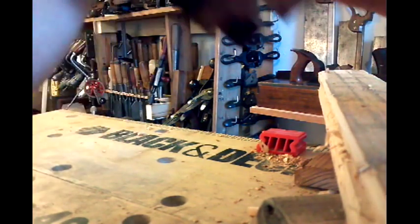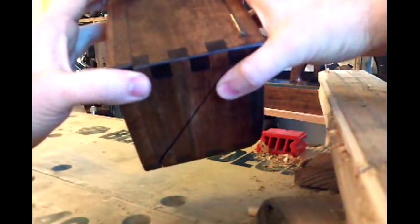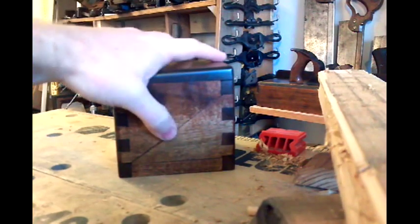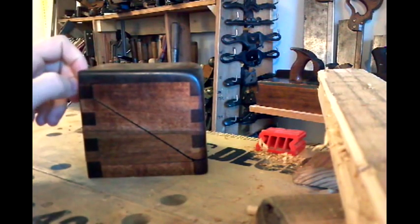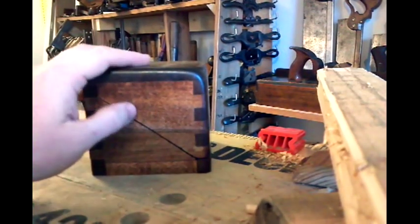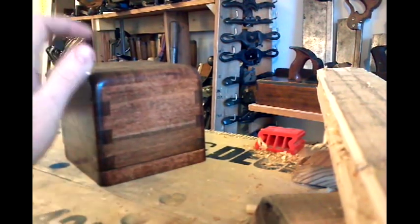That's it — just slides right in. Line it up with the face, make sure the back is lined up, push it together, front slides over, back slides over, and it's locked. If I were to do it again I'd do much tighter tolerances — you can see this side the joint is pretty tight, this side it's a little loose. But hey, it's a beginner's project and it's a lot of fun. If you want to ask more questions in the comments go right ahead, and if you'd like to subscribe I'll be adding more woodworking videos, including timber framing. Thanks very much, bye.